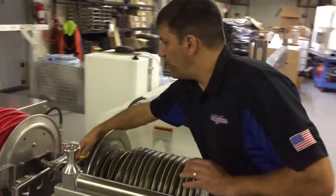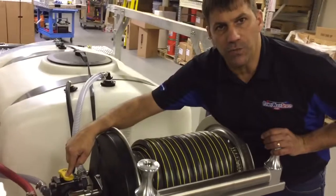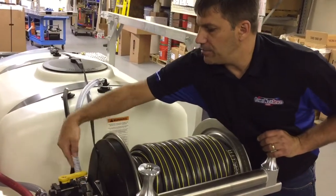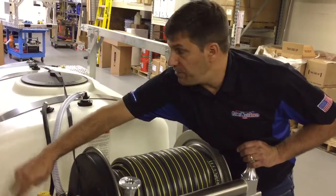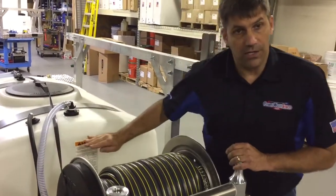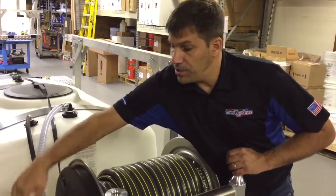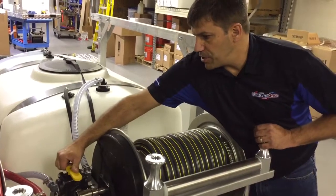I'm going to show you one thing real quick before we come around the unit. Right here, we have a selector valve, and this is your primer valve — one of your two primer valves for your booster pump. When it's turned to the right, it's going to be feeding the tank, and when it's turned straight, it's going to be force-feeding the booster pump. So when we prime the unit, we're going to have to make sure that we have some water in the 200-gallon tank first, then we're going to turn it back from filling the tank over to force-feeding the booster pump skid.